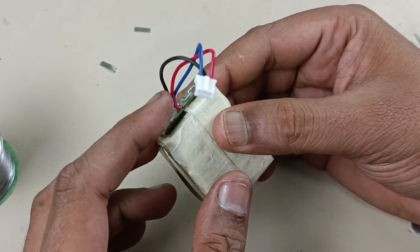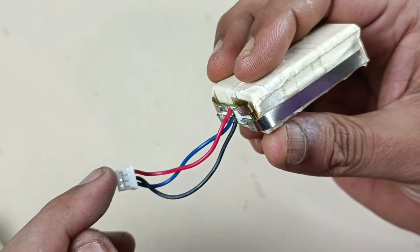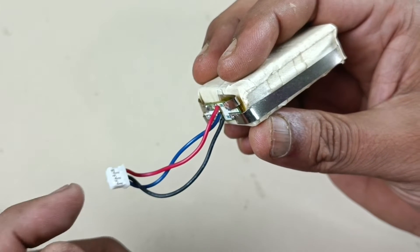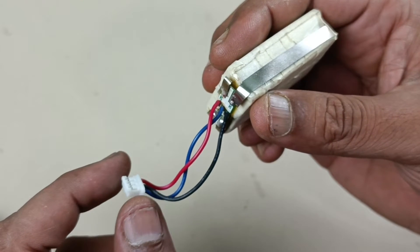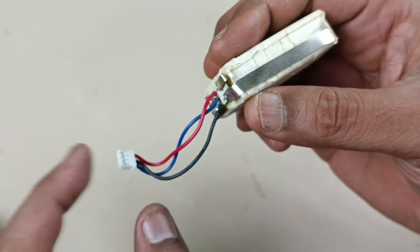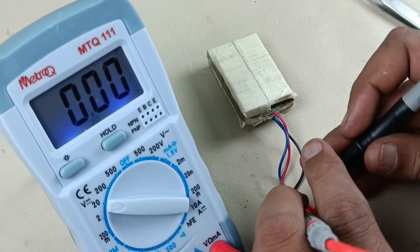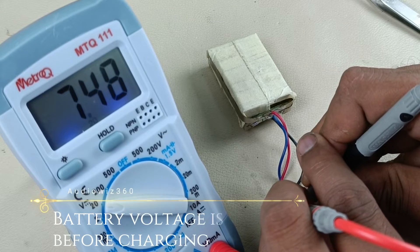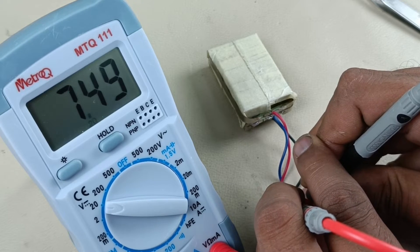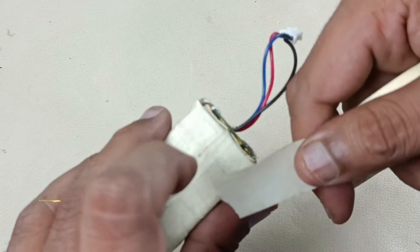The battery pack is ready. Let's insulate it further. Now everything is connected. If you test the voltage at the terminals — plus and minus — you will get zero volts. You have to boost this battery through an external charger, or you can directly assemble it in the speaker and once the charger connects, it will start working. I have boosted this battery just to show you the voltage: plus with plus and minus to minus — you can see 7.49 volts is already there. That is the minimum voltage. After full charging it will become around 8.4 volts. Let's put this battery inside the speaker, charge it, and I will show you the demo.